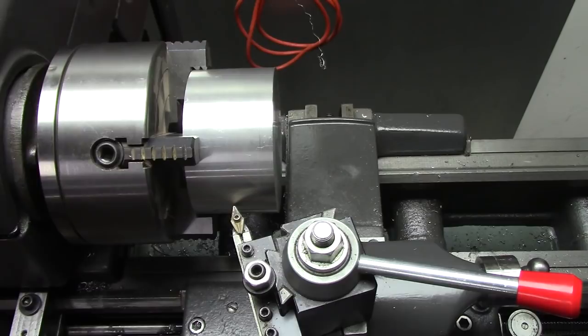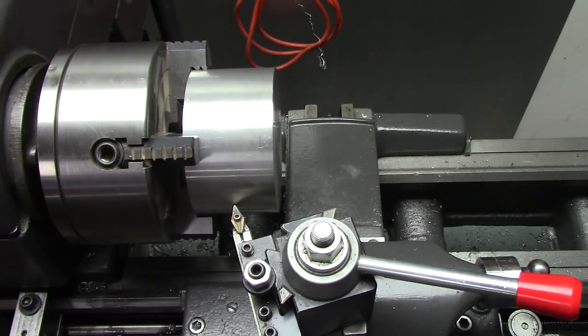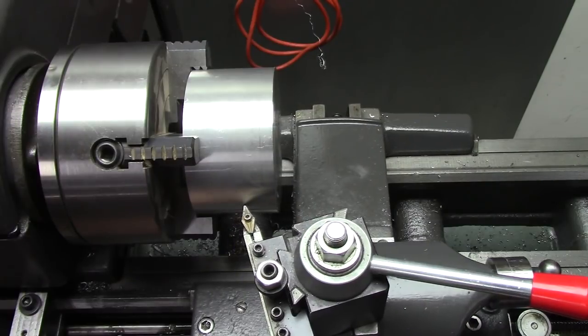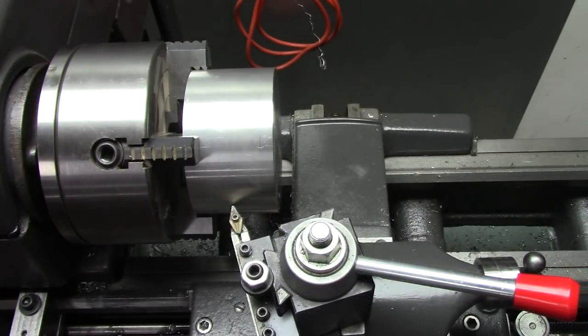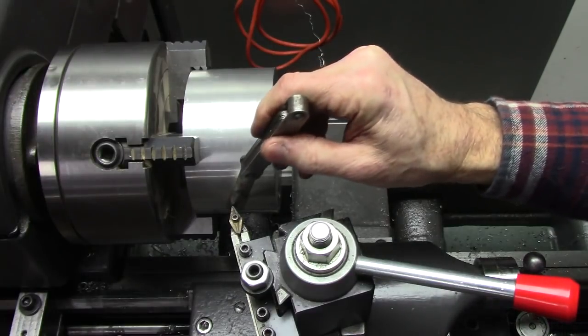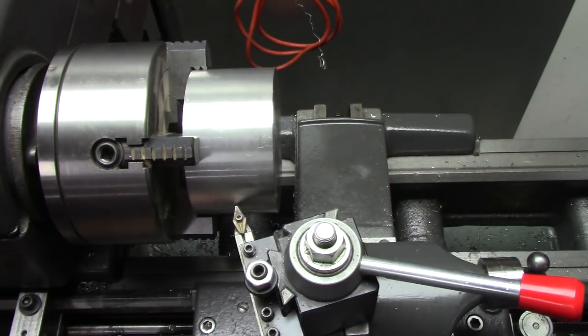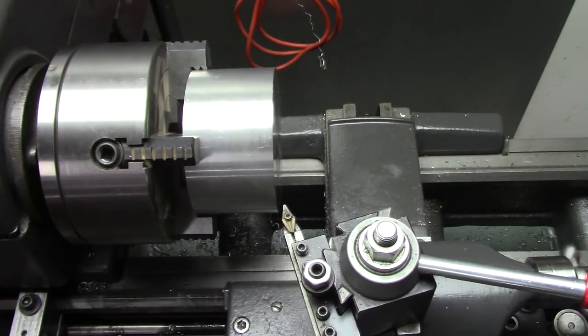Now, on past belt grinders, the one that I'm duplicating right now, it was a 20 thousandths difference, which is pretty slight, and I have no idea what appropriate is, or what is ideal. But I know 20 thousandths worked. I got about just over 20. It's really not critical. 20, 25 thousandths crown. Probably not a problem.